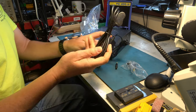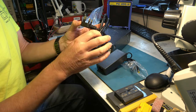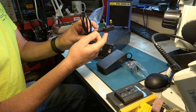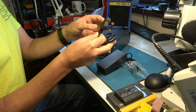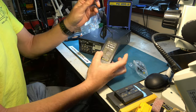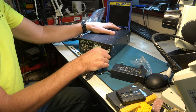Here's the power adapter I've bought with this hilarious mains plug. It's got a sleeved earth pin — that's a complete no-no — and it has no fuse. Why would anybody make a cable like that? It says it's CE marked? Well, it clearly isn't. That's fake. There's nothing for that but the bin. So I will be replying on eBay to this seller saying that you're selling dangerous illegal power cables. Better to just throw the power cables in the bin. The power supply itself may be fine, but that will not fit the socket anyway because both connectors are female.